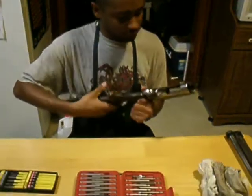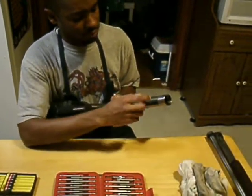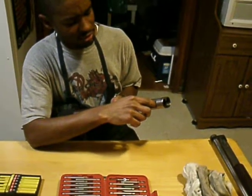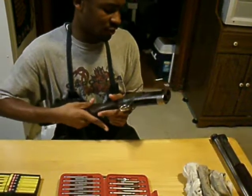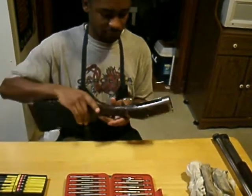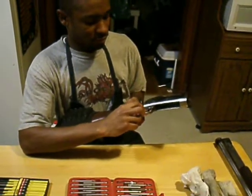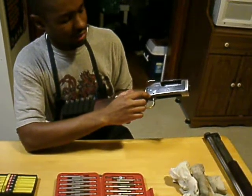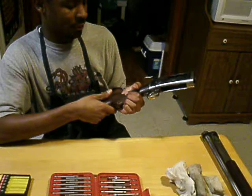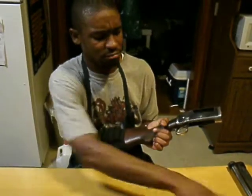There are screws to take out on older models to remove your shell stops and shell interrupter. Also, your trigger guard can come out — there's a pin you've got to drive out first, and you'll probably need to take out the butt stock too. I'm going to do a further disassembly of all these parts in separate videos.